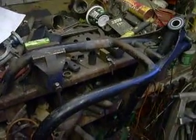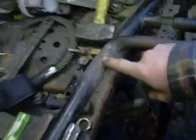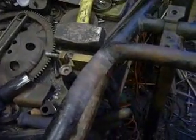Another installment of the diesel bike project. I've got half the BMW frame here. I've got the front headstock with some bearings in it. But what I need to do is alter the angle that the frame tube is bent at to accommodate a lump on the side of the engine, because it isn't symmetrical.